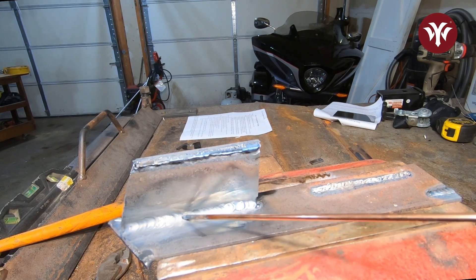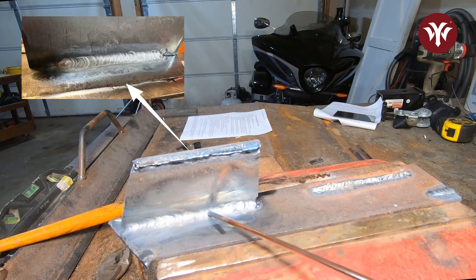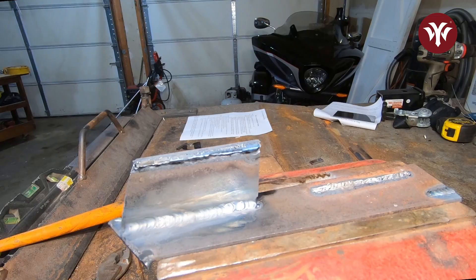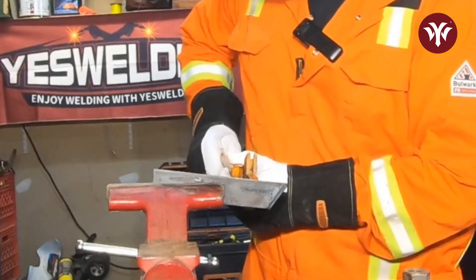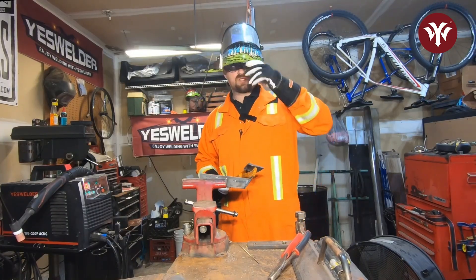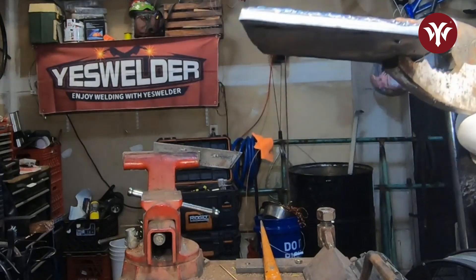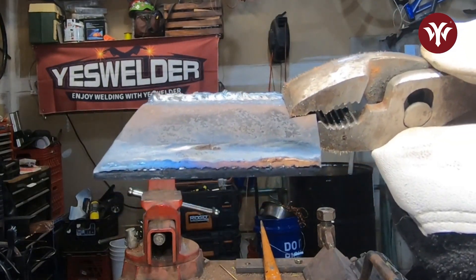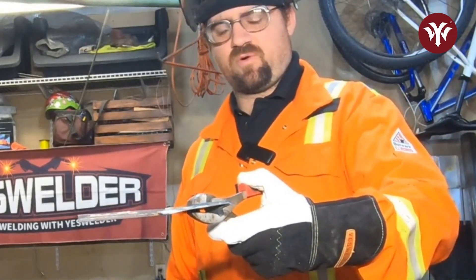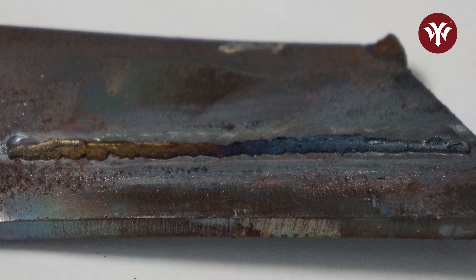You see the difference here? I can see everything that's going on in this puddle. As a matter of fact, I've got a little bit of underfill right here, but ignoring all that, there's no dirt sitting on the top, no shiny spots, no porosity. Let's see if I can break this one off and see what's underneath. Well, you can see the difference already. I go to break that thing off and it starts bending the metal — that wet in a lot better. I don't see any porosity. That color change is from me breaking the weld open while it was still very hot. And trying to break that one apart, that little weld bent this piece of eighth-inch plate. You can see a very clear difference.